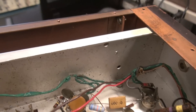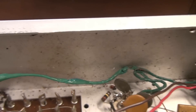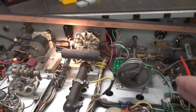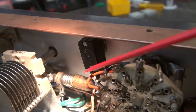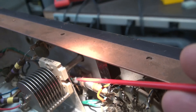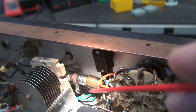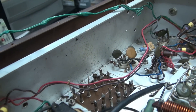It's still going to be quite the job. I've decided to clip the filament wires where they land so I can take this out in pieces and not struggle so much with the harness. Revisiting my comment about one side not being melted — I found the common denominator: it's the 6-volt filament lamp. You can see the wire coming into it is bubbled, but leaving it, it's not. Obviously, at one time a short developed. I'm going to buzz this out — that is the common denominator right there, the pilot lamp. So the short was not on the VFO output socket like I originally thought.